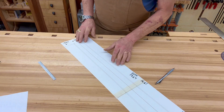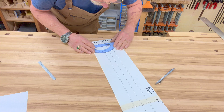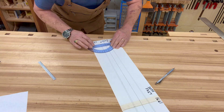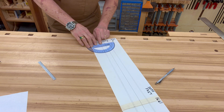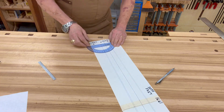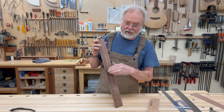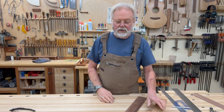No angles required. Even if I were to take a protractor now and try to determine what that angle is, it's so close to ninety degrees — this is only a math-quality protractor, not a professional one — and it's only showing like ninety and a half degrees. It's guesswork if you're trying to work with angles. Now you can draft that same information onto a fingerboard blank and shape it down by whatever means — a band saw and then hand planing. You can use that same information to create a fingerboard shaping template or a tapering jig to be used on a table saw.